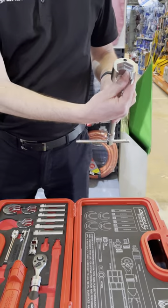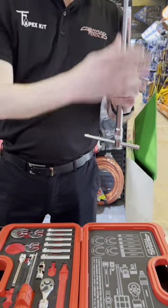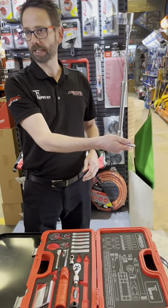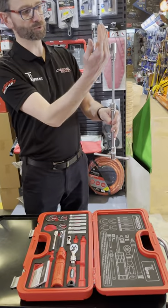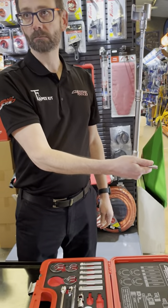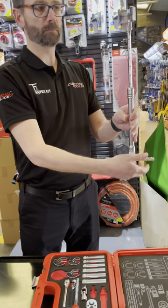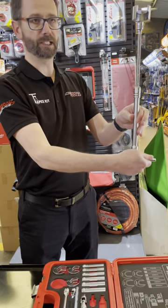What you have here are these segments, which is the patented part of the kit — that's a socket within a socket, if you can see that in there. So if you shove it up under the bath like that, it should be one-handed; you don't need to get your other hand at the back. Keep the water supply on this side of the segment, and on its own it should find the supply nut — it won't go past it because it will sit on that bottom ledge. You might need to give a little shuffle just to clunk it in properly.